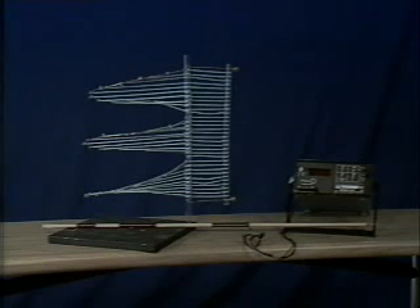The surface for a many-turn coil used in Faraday's law is geometrically complex, as the bounding contour to the surface follows the path of the wire. For a tightly wound coil, the magnetic flux linking this surface is the sum of fluxes linking each turn. Since the magnetic flux per turn is proportional to the number of turns, if each turn links the same flux, the total flux linked by the coil is N times the flux per turn. The coil self-inductance is then proportional to the square of the number of turns.